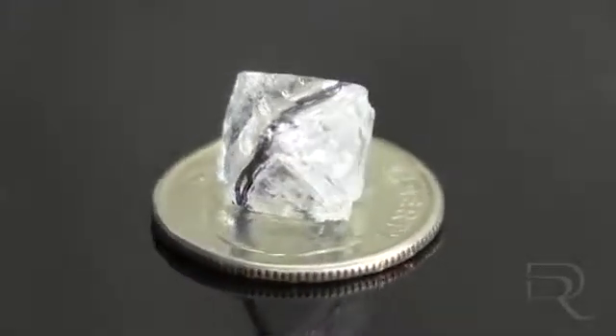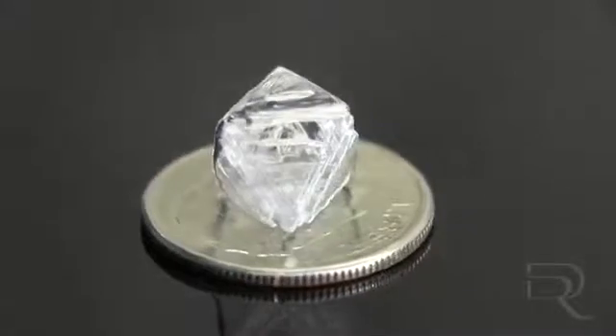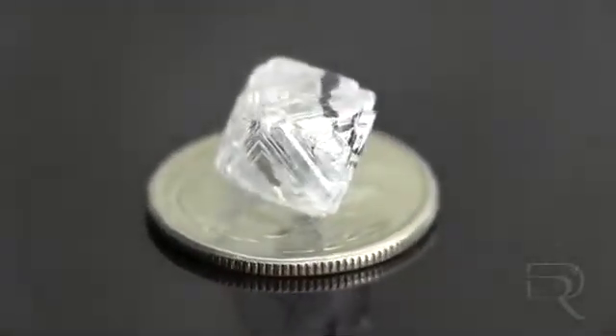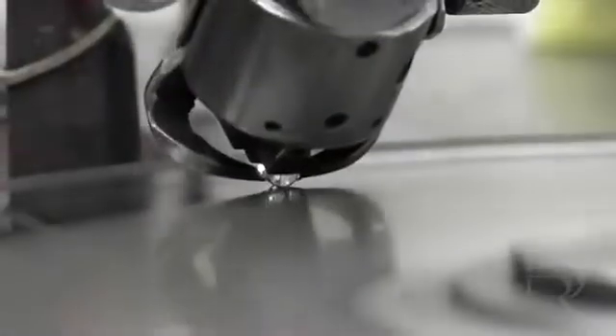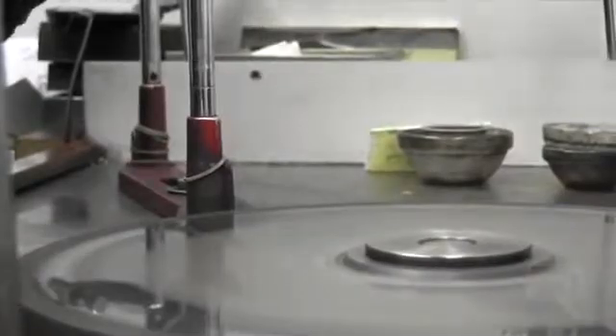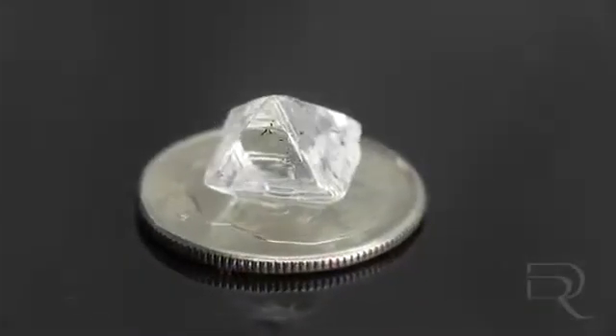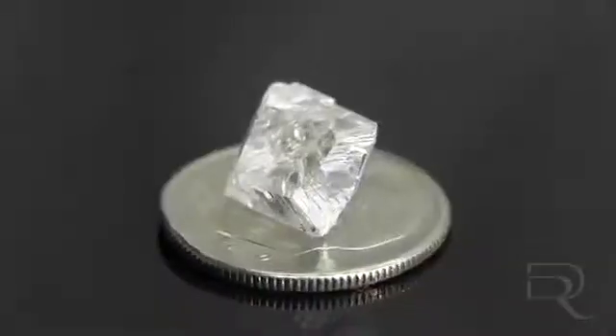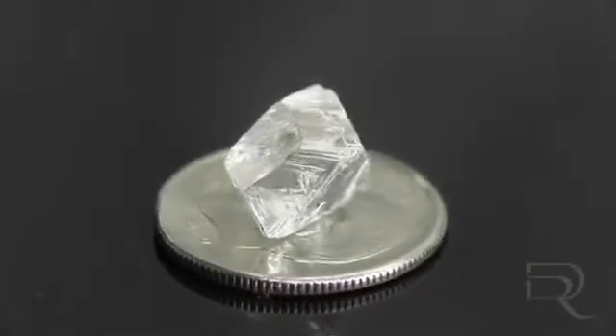The blocker is the lead cutter and supervisor of the diamond throughout the process from the rough material to the polished diamond. His first step is in laying out the diamond in four sections on both the pavilion, or bottom of the diamond, and the crown, or the top of the diamond. This is called four square.